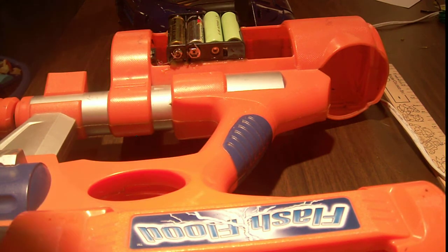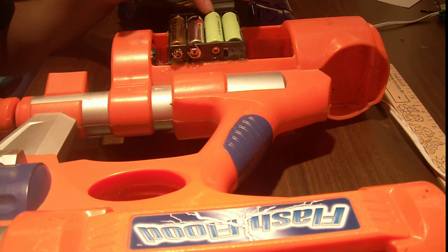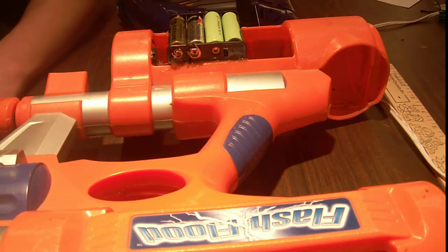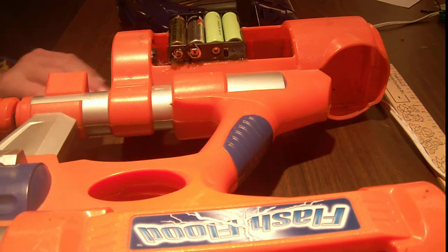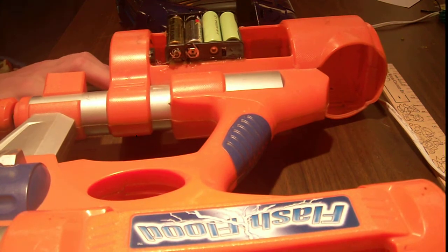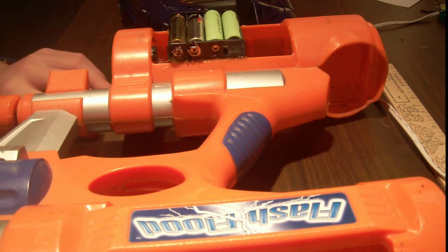It's a lot of fun to play with my brothers and friends, and it's fun to not have to go 50 miles away to play laser tag. I can play whenever I want. It runs on rechargeable nickel metal hydride batteries — gets about an hour, though it's run for two days straight, but at that point you can't read the screen. What I've done for the batteries is put a diode in series to keep the voltage below 5.5 volts, which is just about the maximum the screen can handle. The microcontroller can do about six.